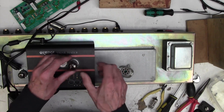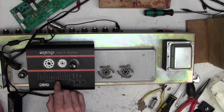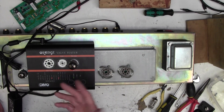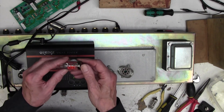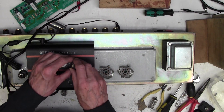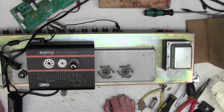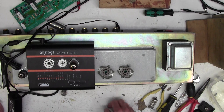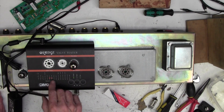Let's try the Valve Art 2040, probably an ECC83 again. We'll let that one run and I'll show you the result. Here we are coming up to the end of the test on the third valve - and that's come up good. A bit of a disparity in the gain, a seven and a ten, but that's okay, so that one's alright. We'll just do the final valve, which has been changed at some point - looks like a Groove Tube, so I'll be very surprised if it's worn. Here we are at the end of the test of the fourth valve - it is perfectly okay: a six and a seven gain, a good signal.